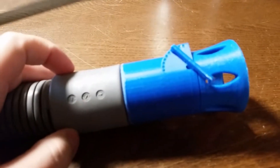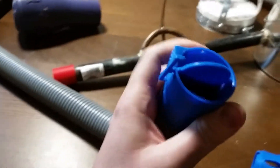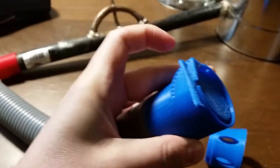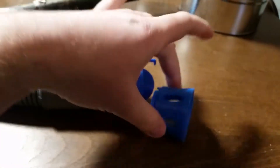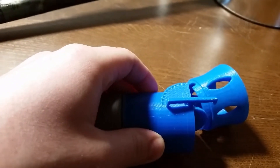So we made essentially a butterfly valve — something I drew and 3D printed. We've got the valve here with some detents; it's not glued together yet so it will probably fall apart. As you rotate the valve you change how much airflow goes down the stem, and any extra just gets blown out these side holes. Hopefully this should give us enough control to change the amount of airflow, and we'll just do basically maximum gas to see if it works.